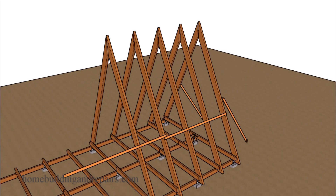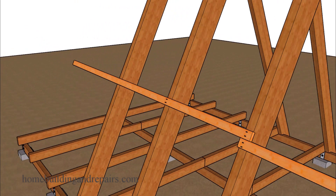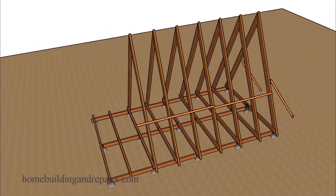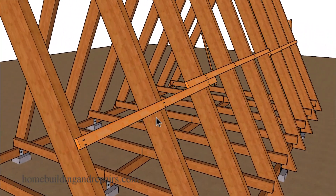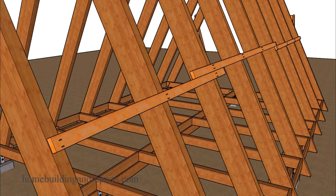We're simply going to continue on with our bracing and rafters one section at a time until we get to the end of the building, then double check that this side is plumb. The bracing is going to need to be removed after you've installed the roof sheathing up to the point where the bracing needs to come out. You don't need to remove it before you install the roof sheathing — just remove it as you work up from the bottom or from the top to where it must be removed before you can finish.